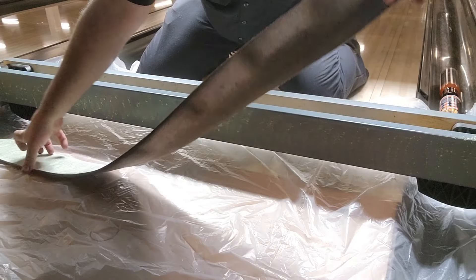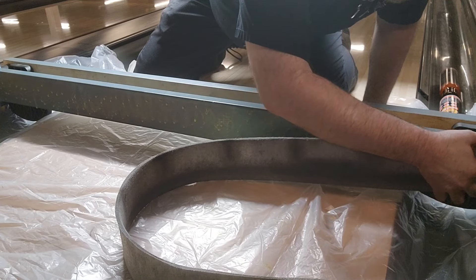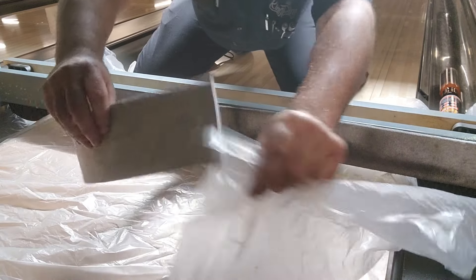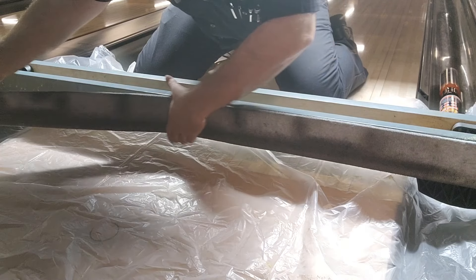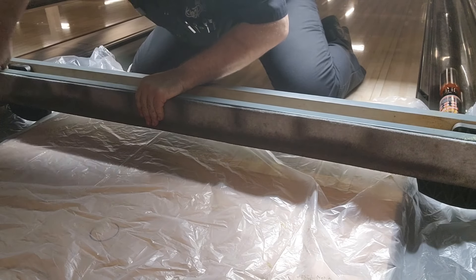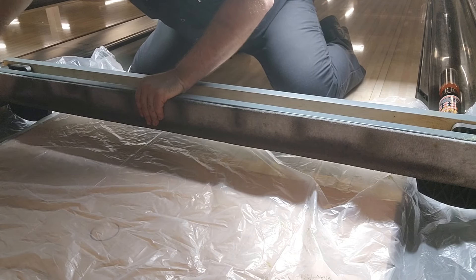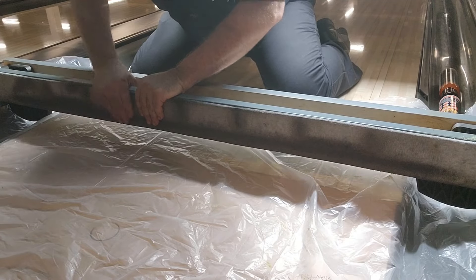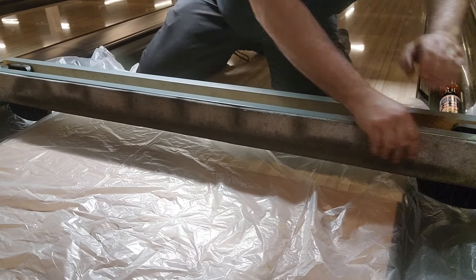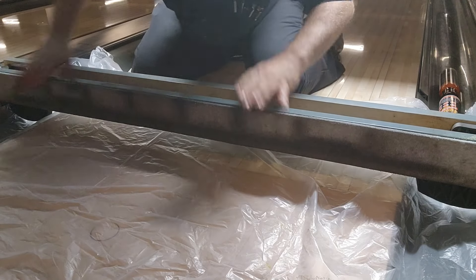It's been about five minutes. With that being said, let's bring our piece in — we're pretty much going to roll it into place, lightly getting it lined up, then smush it down a little bit. This is good, this is perfect. We're about a quarter of an inch off on one side, but it's not blocking access to the holes in the sweep wagon for the bolts, so we're good. Squish it down real good and we're all set — just like new.